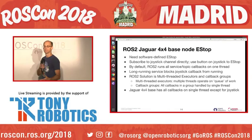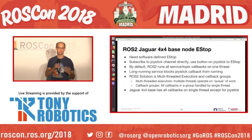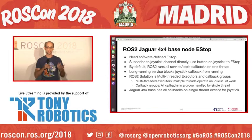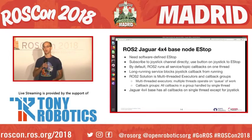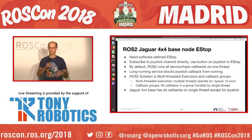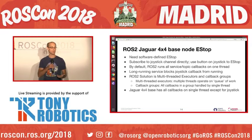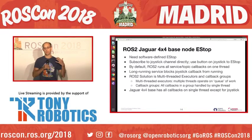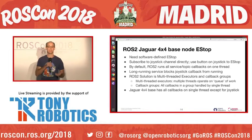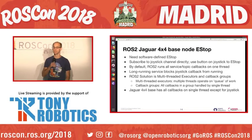So talking more about that e-stop, the reason that's kind of interesting is because we wanted the software-defined e-stop to work in all situations. The robot has, of course, a hardware e-stop, but that cuts power, right, and we have to restart everything, and so it's pretty annoying to use. So for most of our development, we want to have a software e-stop. And originally, we just naively subscribed to the joystick channel, and we had a button on the joystick. And when you hit the button, it would stop all commands and send e-stop down to the robot.